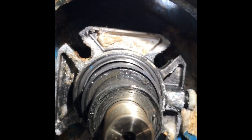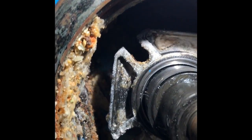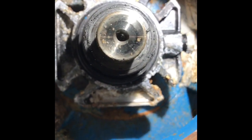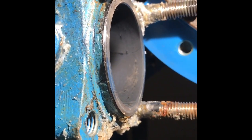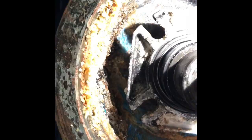Can't tell yet if there's a problem with it. It doesn't look to be a problem with it, but here again, that wasn't greased. If that's sitting there and greased properly, I believe it sits. You've got to make sure your face here is good and clean and right. I believe it sits and seals on there a lot better, and I usually don't see these problems.